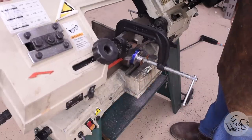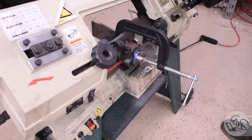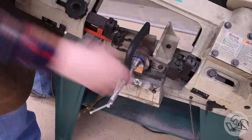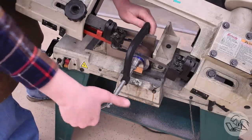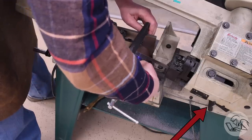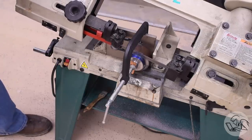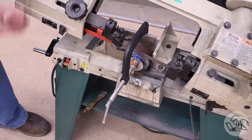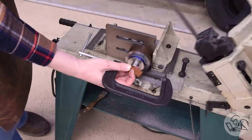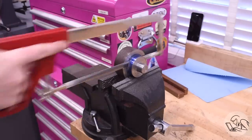The secret to this method is you can't let the saw go all the way through — you can't even let it go past the center. Otherwise that clamp is either going to pinch the blade or it's just going to fall off because it loses tension. So you stop just short of the center line, shut the saw off, loosen the clamp, and rotate the part around and do another cut. Never place your fingers under the blade while doing this because the carriage is sitting on a catch, and if it slips off that's a good way to lose a finger. For a smallish part like this, just two passes — one on each side — stopping short of the center line each time. Then I take it over and finish it with the hacksaw. That works very well.